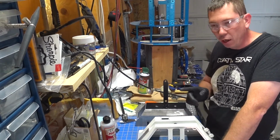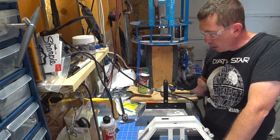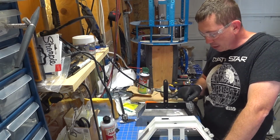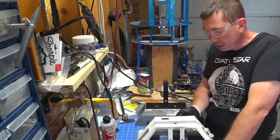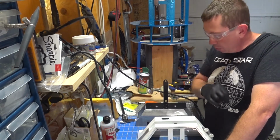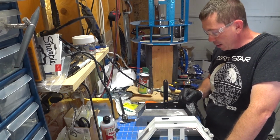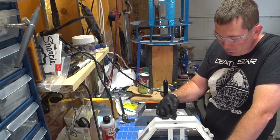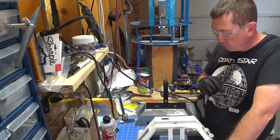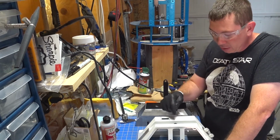So what I've been doing while off camera is I used my calipers and did measurements from the inside of this. The foot shelf thickness is 0.1, so then I figured out how far back from this edge that 0.1 would be, and from this edge 0.1 would be, and then measured from this interior edge to this interior edge. That gave me where it matched up to the 0.1, so this is literally just wide enough for the foot channel.